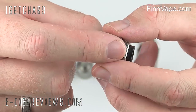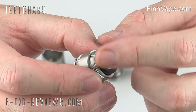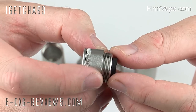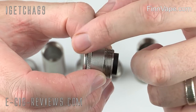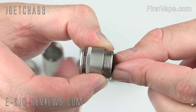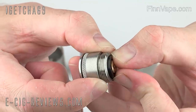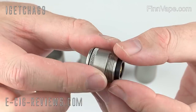As far as I can tell, the switch uses two springs working against each other. The first spring is attached to this black circular piece, and when you've got the battery in position and you're screwing this into the body, the battery will force that inwards and the actual switch part will stick out. Once that's sticking out, you can press the switch, and as you press that, the brass contact pin will come up and make contact with the battery.